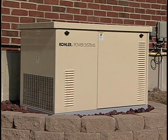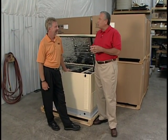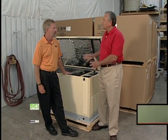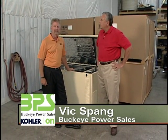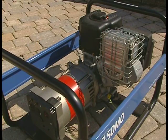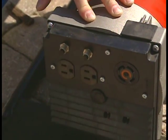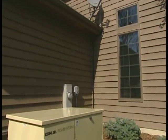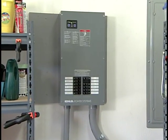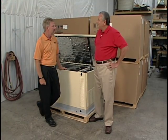Let me introduce you to Vic Spang, he is with Buckeye Power Sales. Thanks for having us out, Vic. So what is a standby generator? Well, the purpose of a standby generator is that it comes on automatically. Instead of a portable generator where you have an outage, have to come out, start it, plug it into a receptacle, and plug your appliances in — a whole-house generator starts automatically when you lose power. The automatic transfer switch conducts that back and forth and you don't have to do a thing.